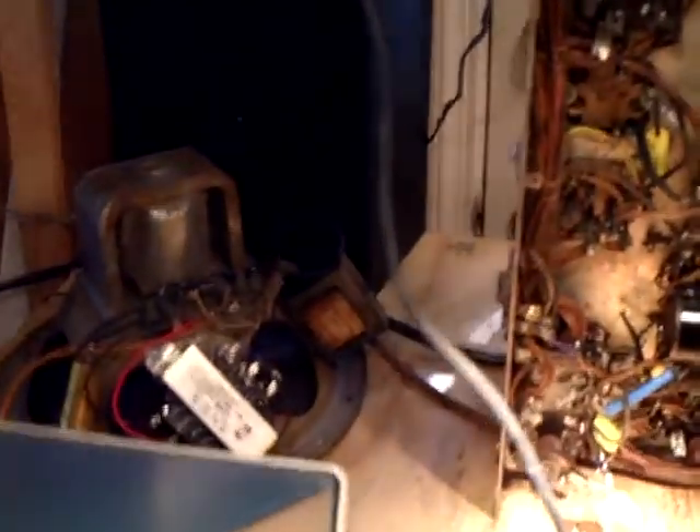Here's the voice coil speaker. I disconnected the voice coil that goes to the audio transformer and connected in an 8-ohm output speaker from a stereo. I'm going to shut the radio off now, disconnect my leads from the audio generator, then turn the radio back on and shut the scope off. I'll turn the lights off too because they make interference. We're going to see how the radio plays to eliminate the speaker as a potential cause of distortion.